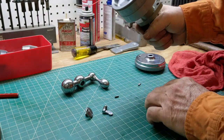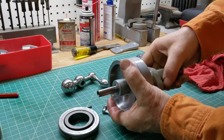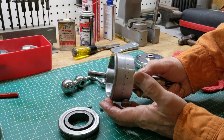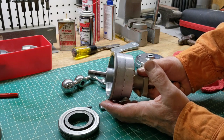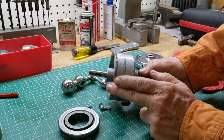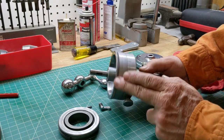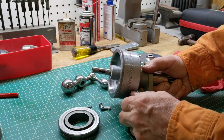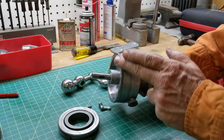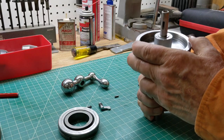Back at this again — I forgot we have these other parts that have to go on. You can see what I was talking about: I have this screwed in, right here at zero, and you get one, two, three turns right back at zero again. So as long as that stop is in, you can only do that three-turn range. Normal operation it's going to be out, which allows you to use the lathe normally. But if you're going to do some threading, you thread that stop in and it'll stop every time on zero.